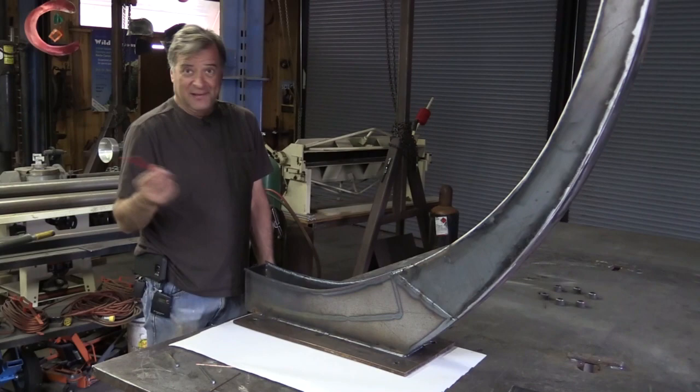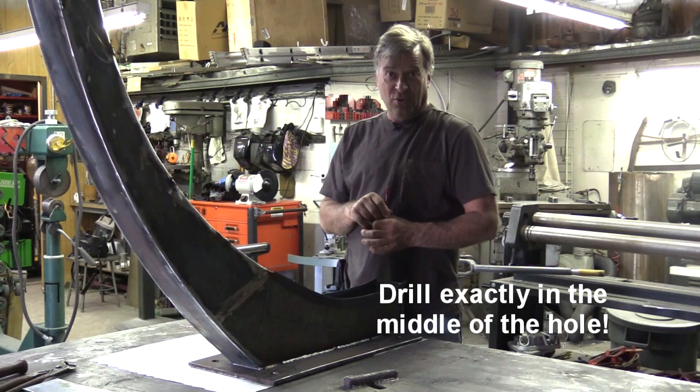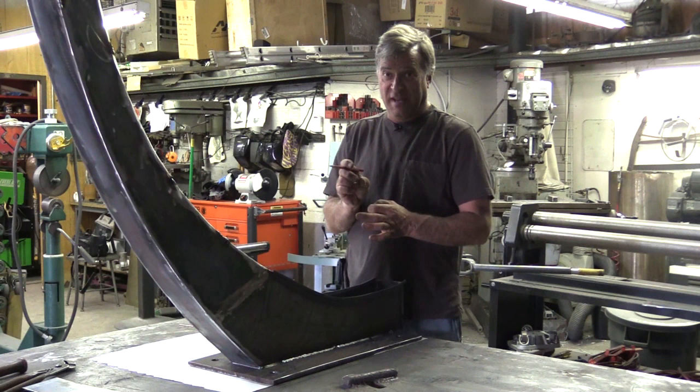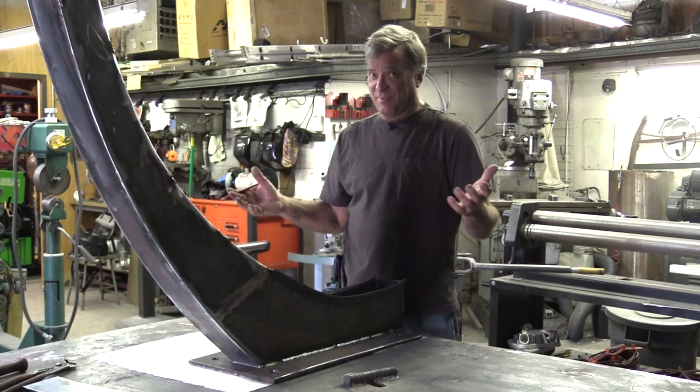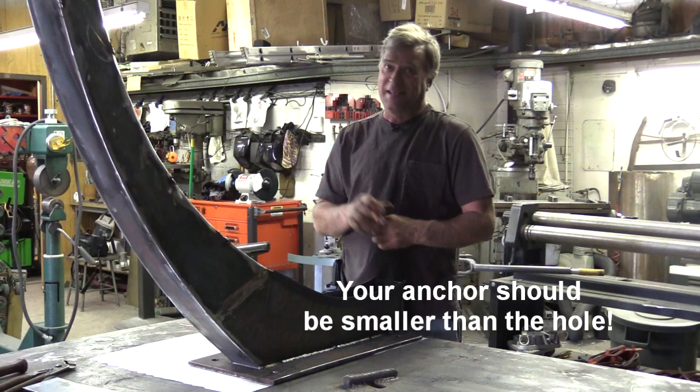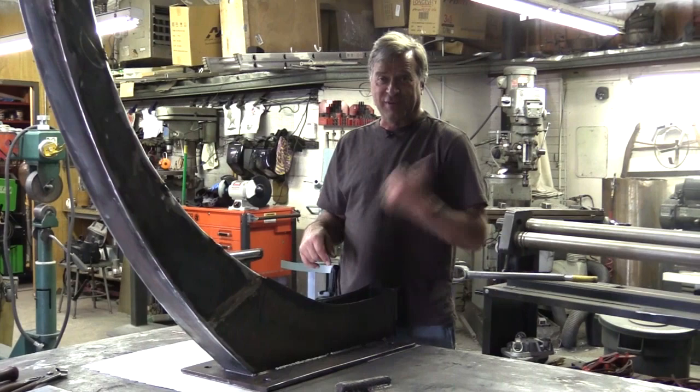One other little tip I'll make sure I mention to this gentleman: make sure you're exactly in the middle of the hole. Don't get off even a little bit — even though we've got about a quarter of an inch of wiggle room in there, it wouldn't take much to get an anchor all the way off where it won't go in the hole. Then you've got to pound it over, drill it out bigger, and you've got a bigger mess on your hands. Always center right in the hole, and don't get an anchor that's exactly the same size as the hole either — always get the next size down so you've got a little wiggle room, a little 'oops room' as I call it.